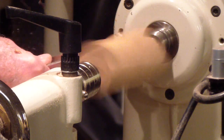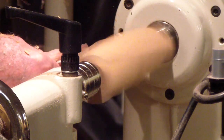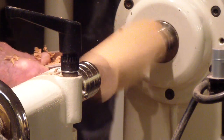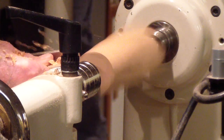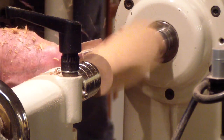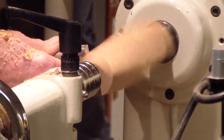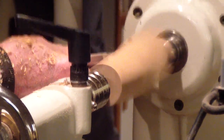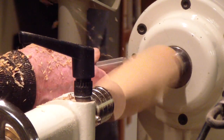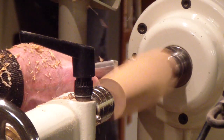We're gonna get off. Take your time getting into these things because if you turn a hump on this side, that's another thing. Sometimes you like to stop and see where you're at. Now this side I'll turn it through. You can watch the shadow here and see where you are in relation to round.